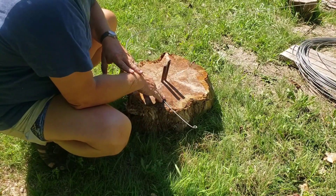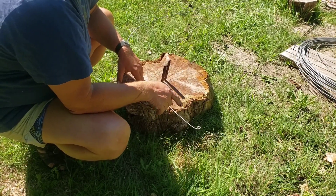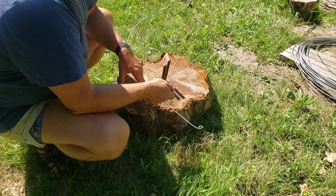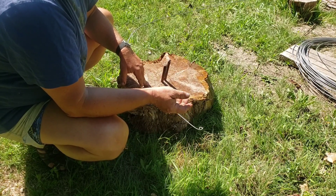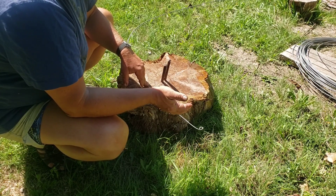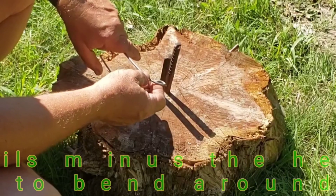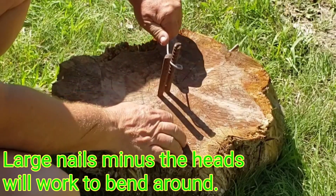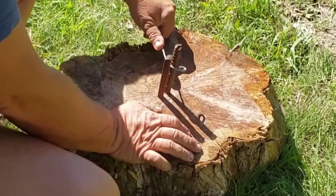I'm not going to make the iron rod — finding iron rods is kind of a trick. What we have out here in the Midwest is a whole bunch of number nine wire. Granted, this is galvanized, but once I get it formed up I'm going to throw it in a fire to burn all the galvanizing off, wire brush it, heat it back up, and dip it in canola oil, which will give it a black finish that'll make it kind of nonstick. I may have to do that several times. First off: pliers, a bit of a hammer, and just roll the number nine wire around. Number nine wire isn't overly hard to do but it can be a pain sometimes.